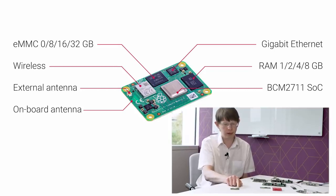At the top over here we have got the Ethernet PHY. Now that's a novelty, right? We haven't previously put Ethernet on a compute module. No, so we've got that built in, and that means it's now much easier to interface to Ethernet, because all you now need is just the external mag jack. So there's no extra silicon needed on your interface board to get Ethernet interface connectivity.